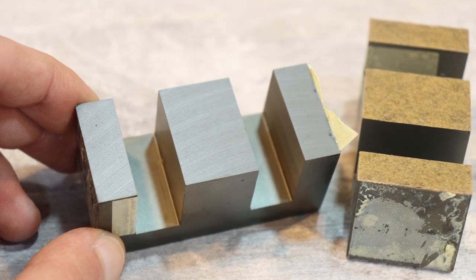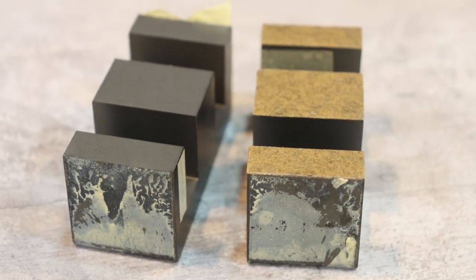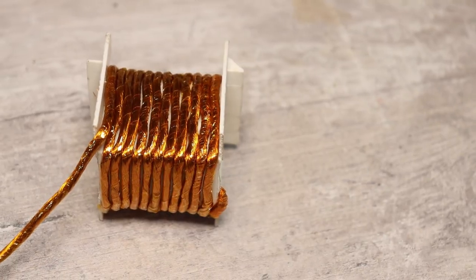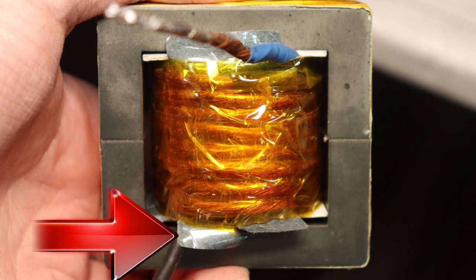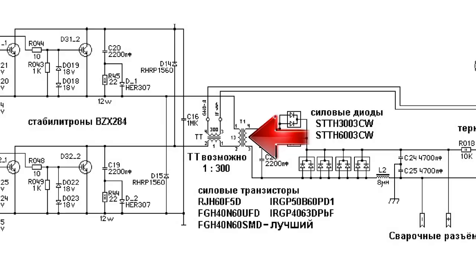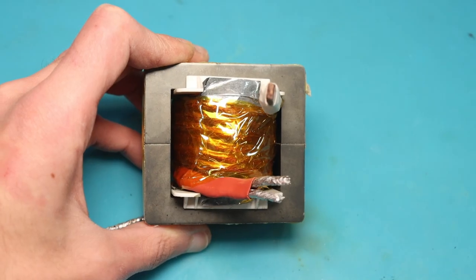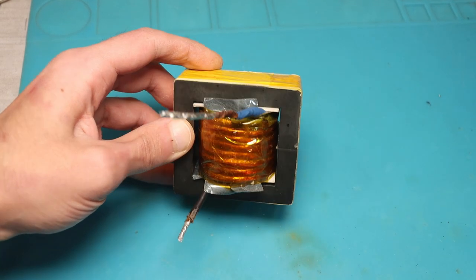Power transformer: the core is W-shaped, E-E70 of colossal dimensions. Between its halves there is an optional gap of 0.1 mm made by masking tape glued to the cores. The primary winding is wound with litz wire — wire diameter is 0.24 mm, the number of strands is 100, and the cross section is about 4.5 square millimeters. The number of turns of the primary winding is 12. This winding is insulated with several layers of Kapton tape and paper insulation. Litz wire is additionally insulated with Kapton tape. The secondary winding is also wound with copper litz wire — the total number of strands is 180, the diameter of each wire is 0.35 mm, and the cross section is about 17 square millimeters. The number of turns of the secondary winding is only 4. The finished transformer is assembled, the halves are pulled together with Kapton tape, and it is also desirable to glue them.